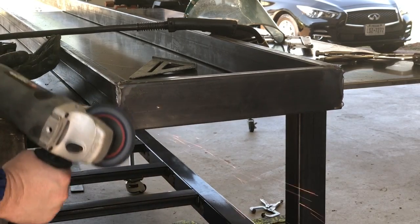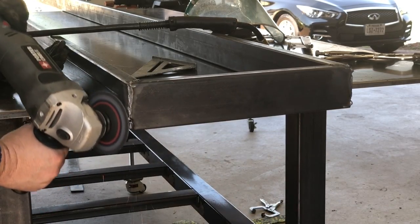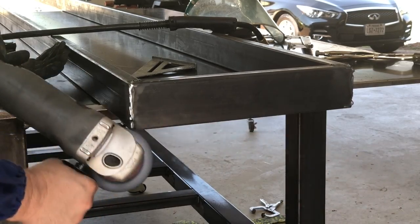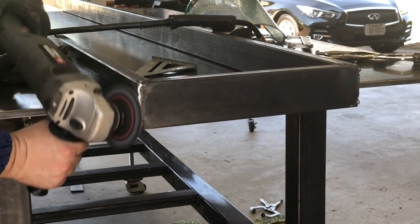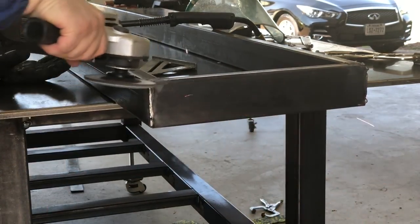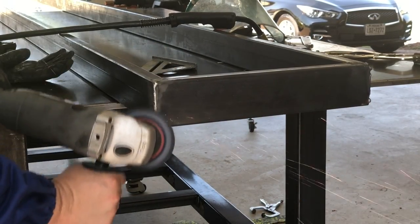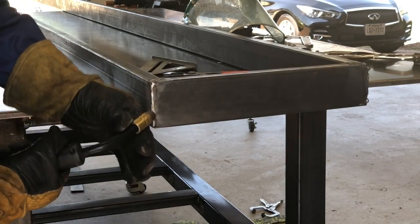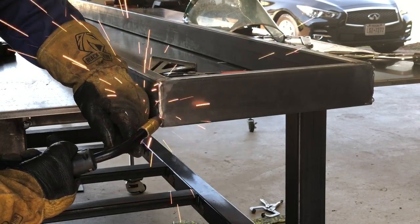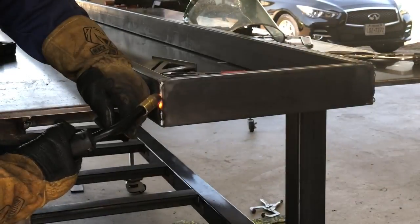As you can see, this is a great example of a beginner welder. In my defense, those edges are pretty hard to weld — this is 24 gauge, one and a half by three inch material. The 24 gauge is pretty thin so it is hard to do anything on that edge. Just weld it up the best you can and then grind it off. Go back and fill in the spaces that didn't get welded good and grind it off again. Before you know it, you've got a really nice looking corner. That's the great thing about welding — if you don't get it done good the first time, go back and do it again.